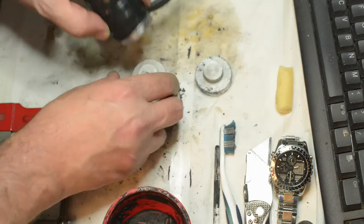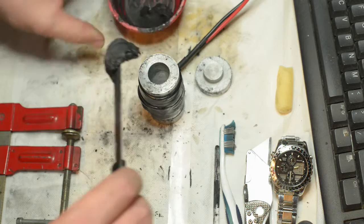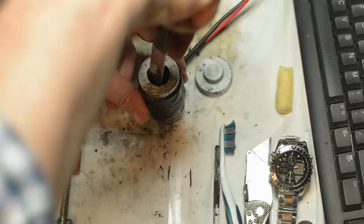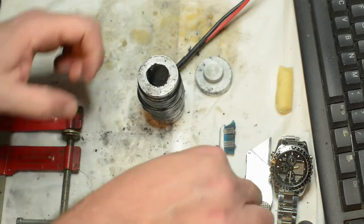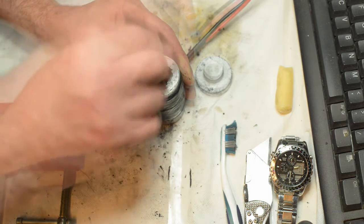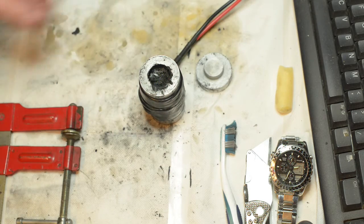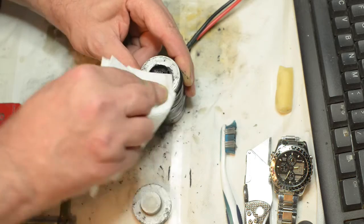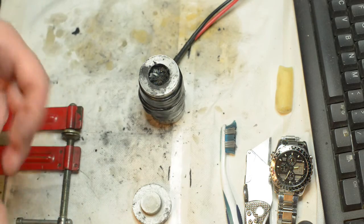Now we'll start placing the mixture into the main mold body. A good thing about this mixture is that you can't exactly spill it. Compacting is very important, as I alluded to earlier. Here we just need to give it a bit of a wipe. Compacting, of course, ensures or tries to ensure that no air pockets are introduced into the mixture.